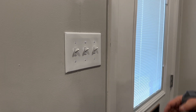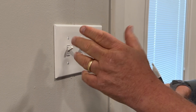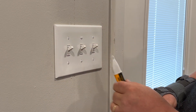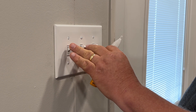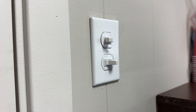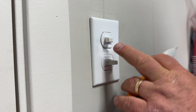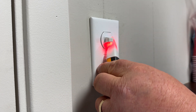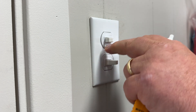On some of the modern new plastic switches in your house or business — the quiet switches — the wiring is usually towards the back and the plastic doesn't give you any indication that there's power there, no matter where you check. The old ceramic ones were a little different; the wiring was up closer and they will go off every time. If you have one of the older or clunkier style switches, it will read pretty quickly. You're always going to want to take the faceplate off anyway if you're working on it.